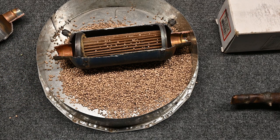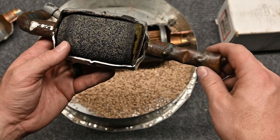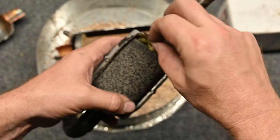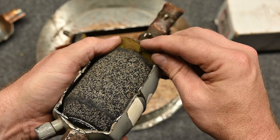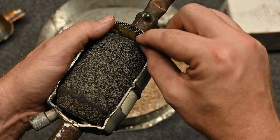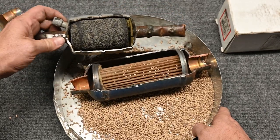There's more than one kind. This kind uses loose BBs — the individual desiccant material — but they also make a solid type. Here's a solid desiccant; be careful not to drop these because they can break. The refrigerant comes in from this side and goes all the way through the edges to the very center, filtering out the material. Then we have a filter layer, a little screen, and beyond that a piece of perforated metal holding it all together. So if the desiccant comes loose it gets caught in filter number one, screen number one, and screen number two. It's really robust. So you have solid core and then you have the desiccant or individual BB style — those are the two basic styles.